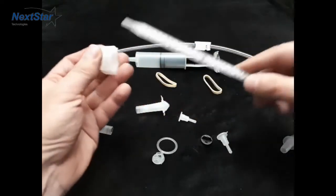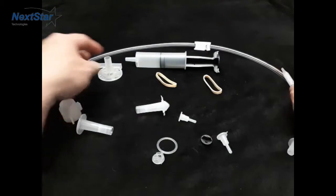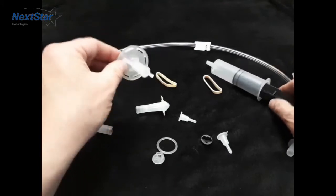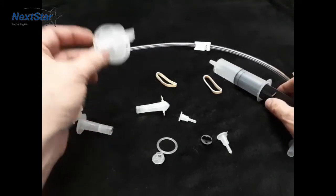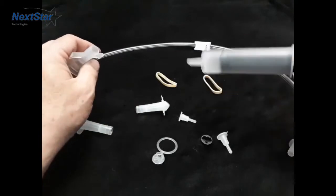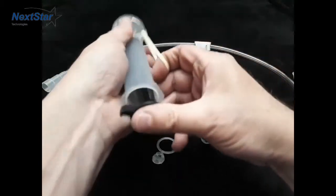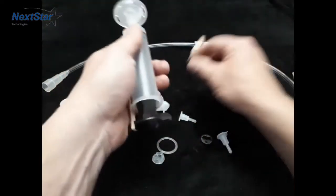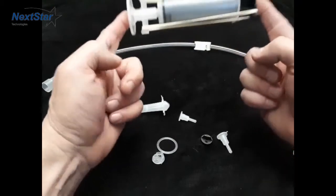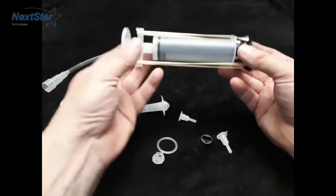This is the retaining nut — it fits over all of the standard mixers. This is an auto-injector. It's not using an injection gun; this port is pasted on the wall. Your product is mixed up, sucked up into the cartridge, and the cartridge is put in place on the wall. Then these elastics are put on both of them, maintaining 40 pounds pressure without a problem. The advantage of these is if you're fixing snap ties or pin holes, you don't need an injection gun — you can put the product in, put these on, and basically walk away.